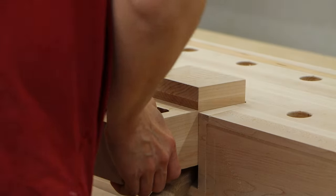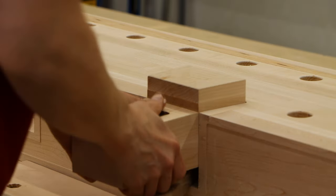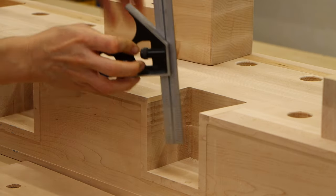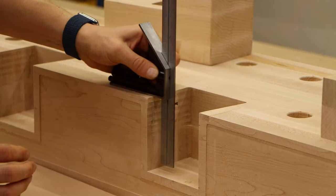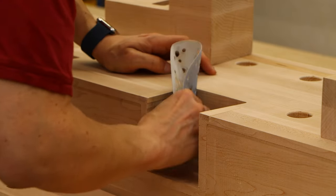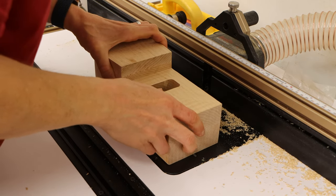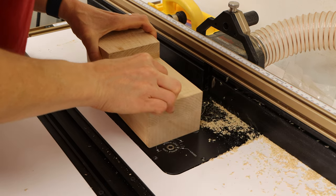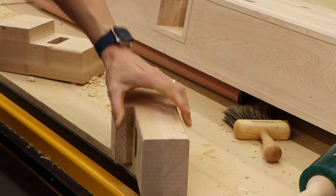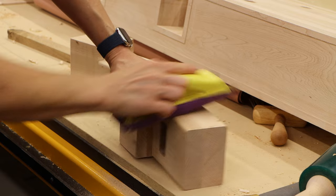Getting the tenons to fit perfectly in the slots was a process. Luckily, my persuader was available to unstick them. And after a lot of measuring, and cursing, and sanding, I got a nice smooth fit. On the entire build, I used roundovers on all the mortises and tenons — and that's mainly because I'm lazy. Normally I'd square these off, but looking at all of those 5 inch deep mortises? No thanks. I think the round looked pretty cool though.